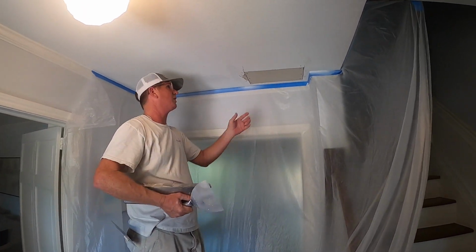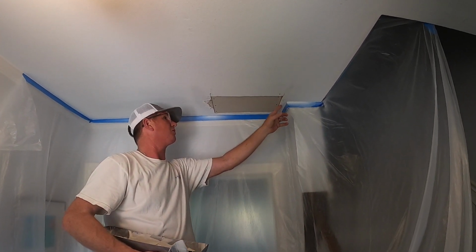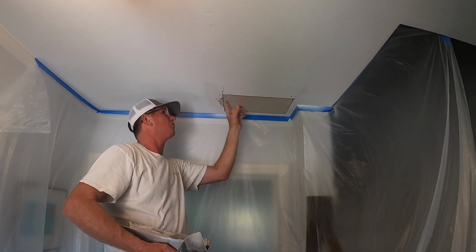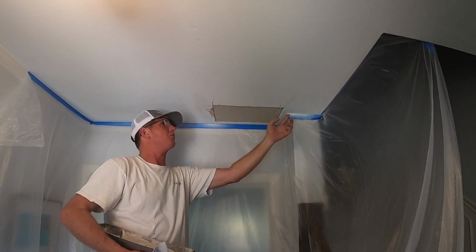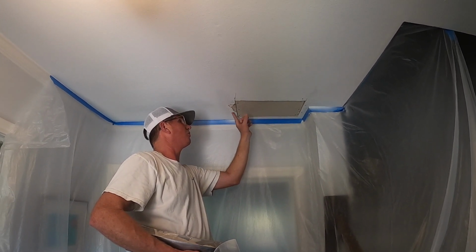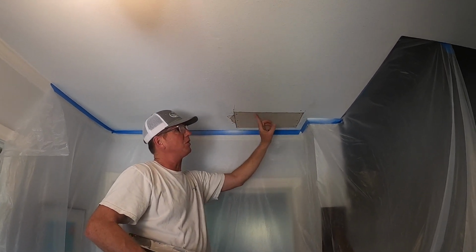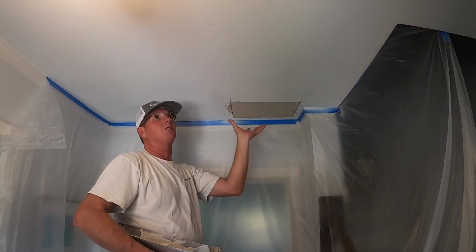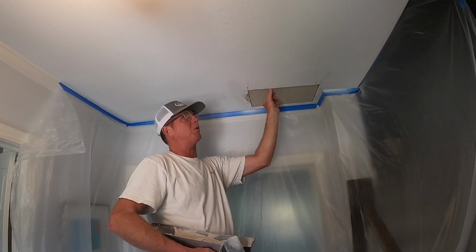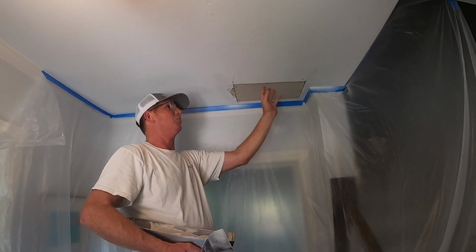So a couple quick things. You can see we hung the patch, obviously. We got lucky, we found a stud here, so I use nails on the small stuff. So we just nailed 3 on each side. Then I'm gonna put 1 on the outside to tighten up the old rock. And then I'll put 1 and 2 here as well to tighten that up. So I'll put the recessed edge towards here. This is going out here, so I'm gonna put a recessed edge, which makes this a low spot, but that keeps me from having to bust mud out here. So I did that on purpose.